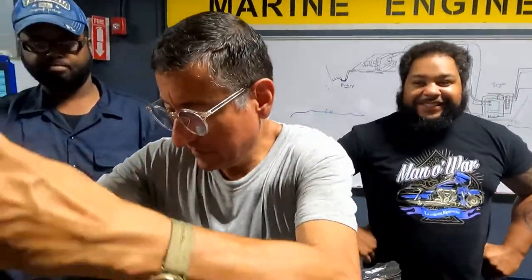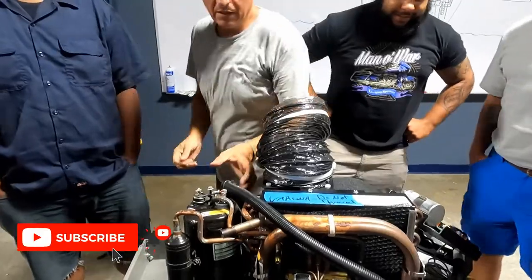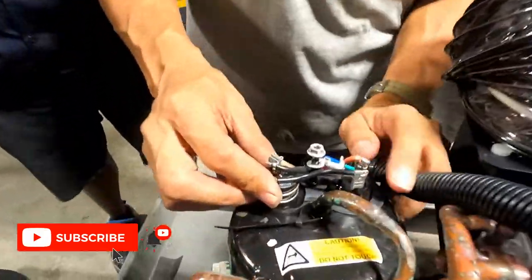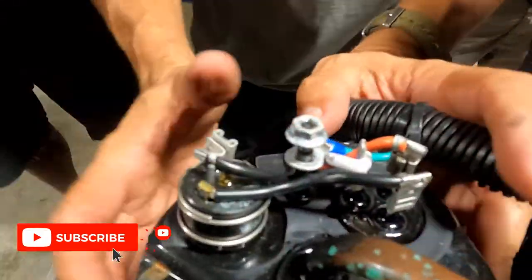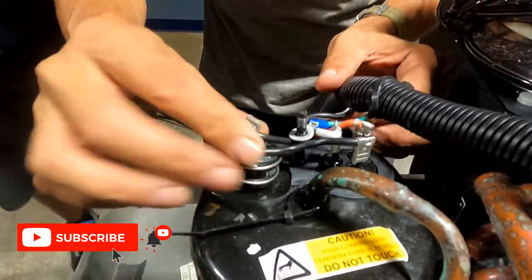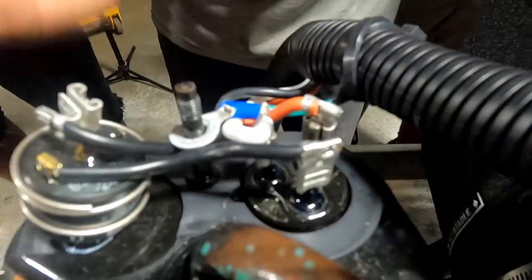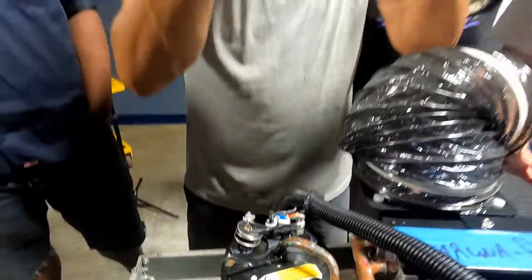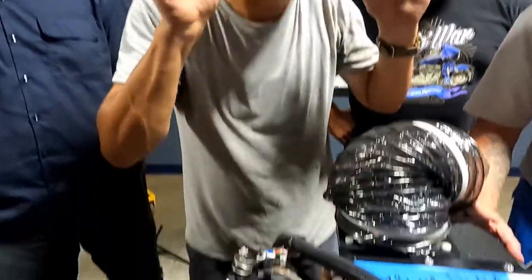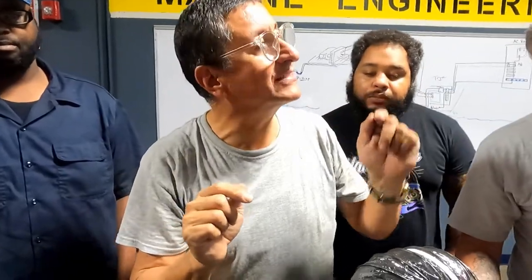In the compressor you have one thermal relay, one thermal switch, and one relay. This motor is a double-winding electric motor — two windings, like two phases: one winding for run and another winding for start.